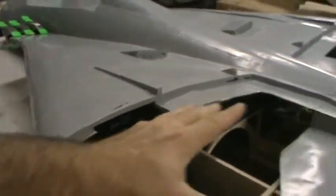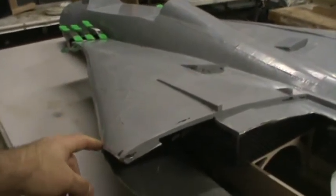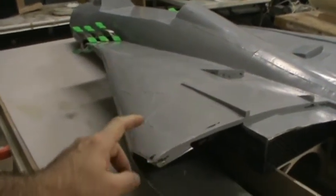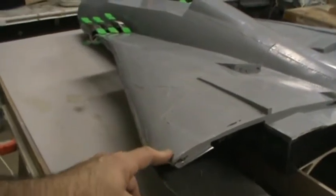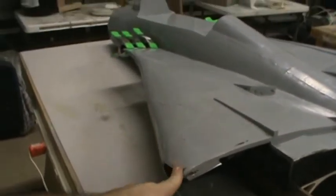That's what sucks about doing a combination of hand-built plugs and CAD stuff — you've got to work it out. I've got paper drawings for all these parts, and my dimensions for the paper parts and the machine parts as far as the pivot are dead on. The difference is the hand-built plug: this portion of the wing actually comes out about a half inch further from the bulkheads. So I have to adjust the drawings and send those off to get cut out again.